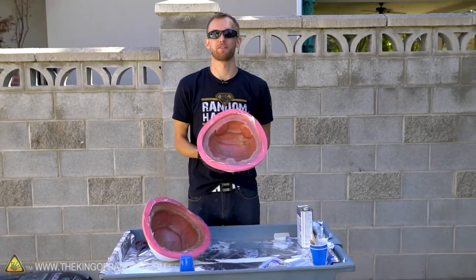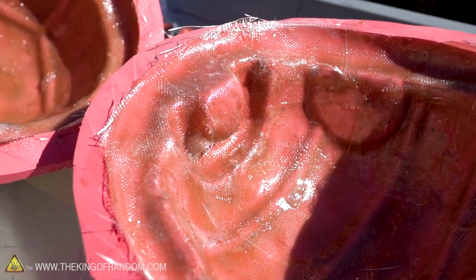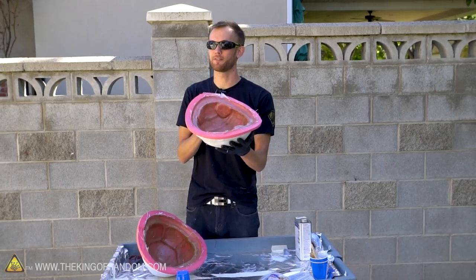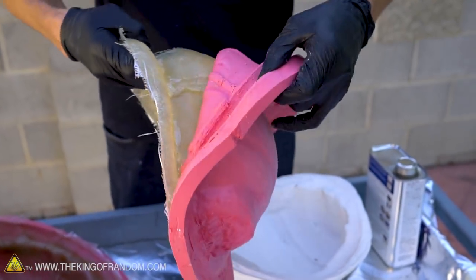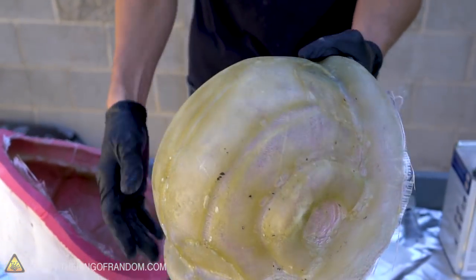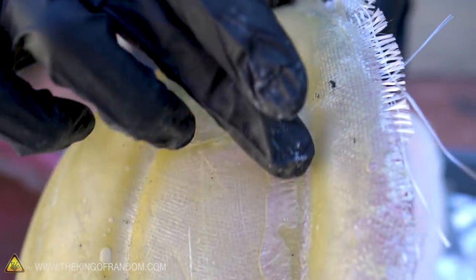We now have two layers of fiberglass cast in both sides of our mold. The fiberglass has cured and is rigid, so it's time to peel what we've cast out of the mold. With two layers the fiberglass should be fairly strong but still slightly flexible, which will help us de-mold. First step is to remove the mold jacket, then we peel off the silicone. We have a fiberglass casting of a turtle shell — it turned out great! A few air bubbles in a couple spots, but we can patch those up.